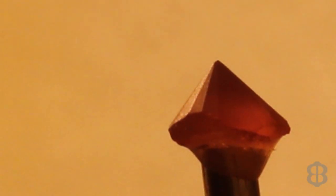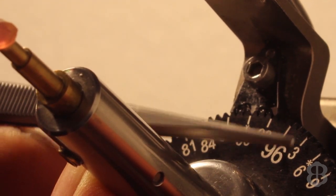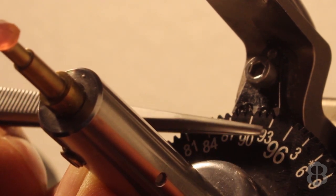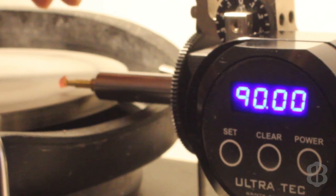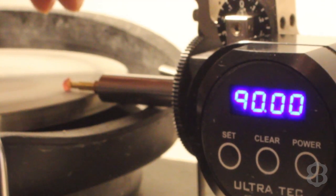Okay, we put in our 1200 crystallite disc lap into the machine, and this flattest part is at the 90 tooth of our index. So we put our 90 tooth of our index, even though we start cutting at the 96 according to the instructions and go every 6, 90 is the flattest part. When the stone touches the lap at the 90 tooth, it's going to be the flattest part of this stone and the lowest part that will go right there.